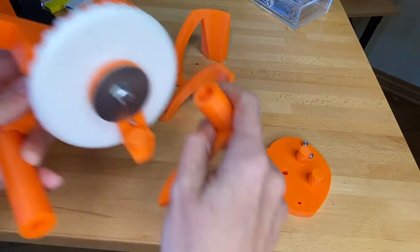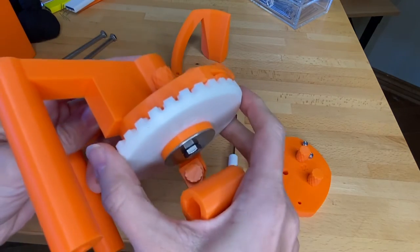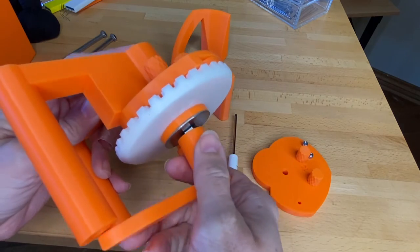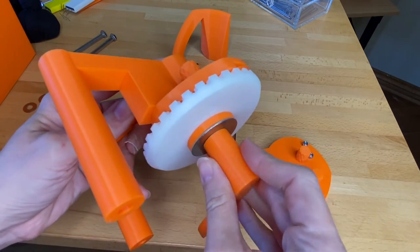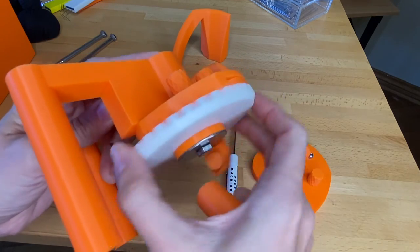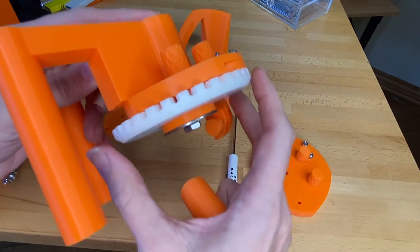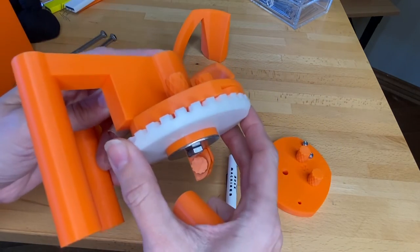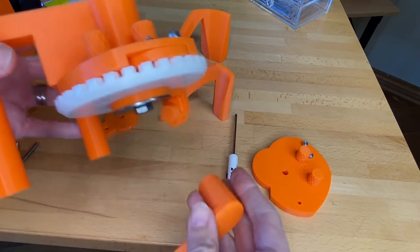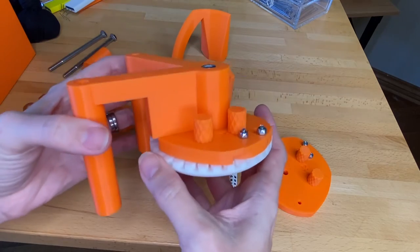There's a nut — first tighten it by hand to get it started, then use your wrench to tighten it on. Tighten it until it can just barely turn, then a little more. You want it pretty tight with no give in one direction, but you do want a rocking motion. You really want it to be sandwiched onto the tappet plate. That's everything you need for your actual setup.